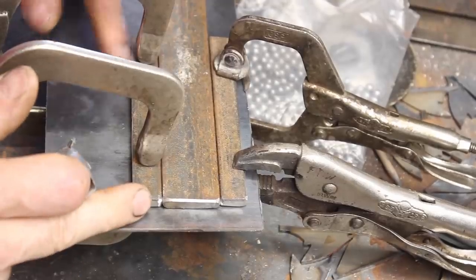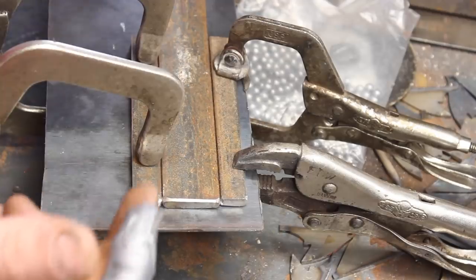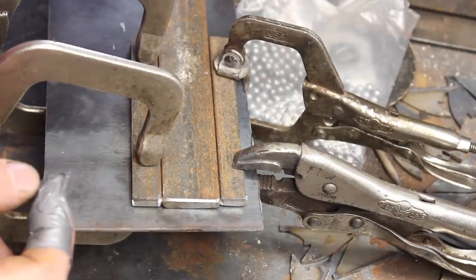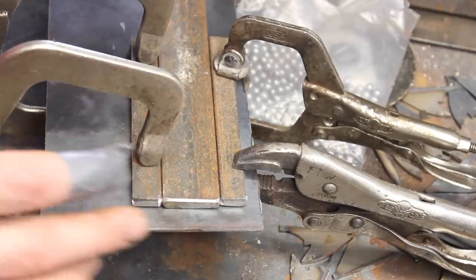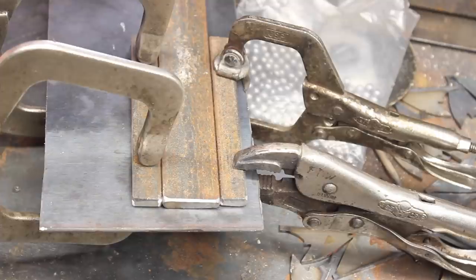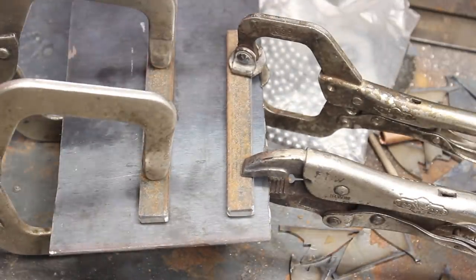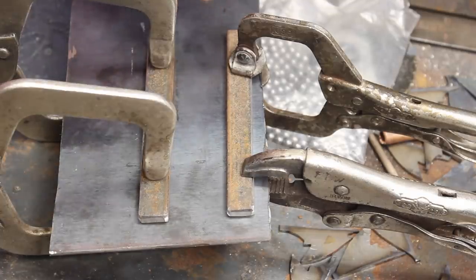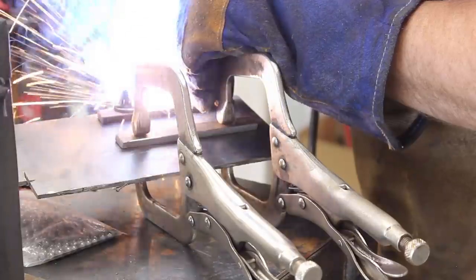Okay, so we've got our two bars clamped on either side of our 1¼-inch bar, which is a denominator of our 1/4-inch size. That means that I can line 5 bearings straight up. No problem, no extra gaps. This is just a couple ways to keep this super simple and easy. Now, I know that welding up a whole deal here to make a custom can doesn't seem super simple and easy, but what we're doing here is putting the preparation on the front end, and it's gonna make a lot less work on the back end.